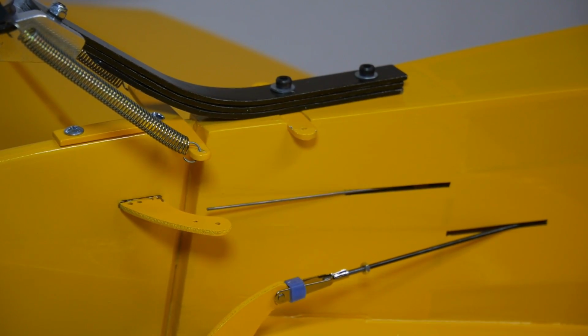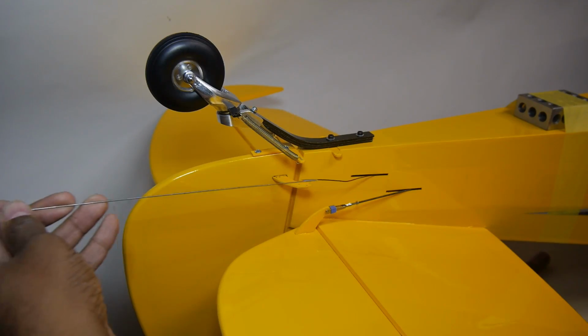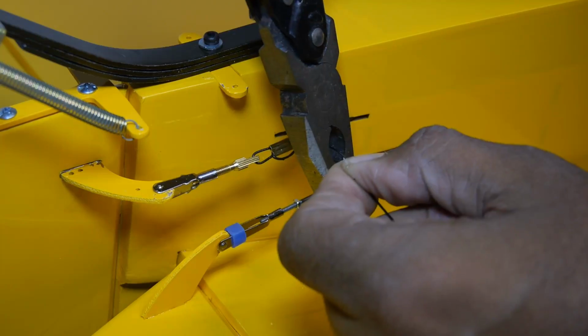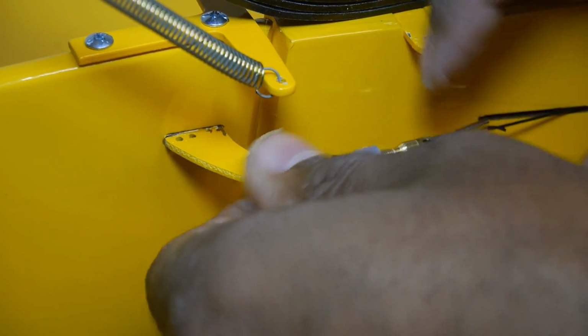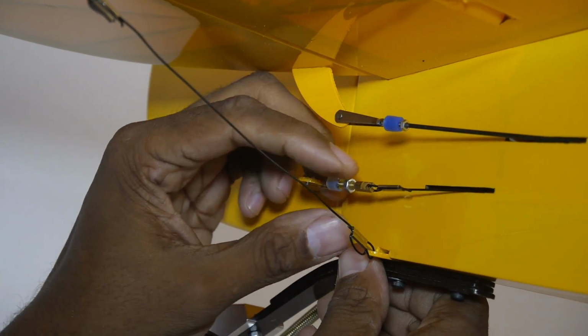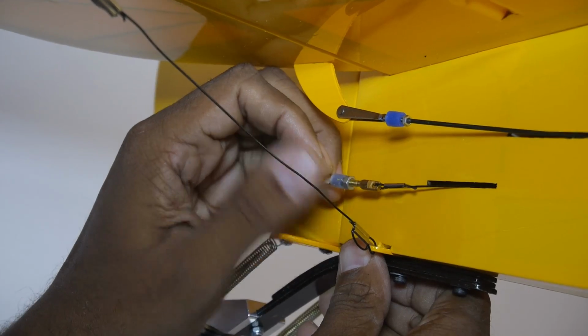The cable is too soft to push through the slot easily, so I taped a thin metal rod to the end as a pull guide. Repeat the crimping process just like before, but be sure to allow enough space to thread the couplers tight. Oh, and don't forget to jam nuts like I almost did.